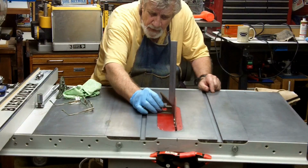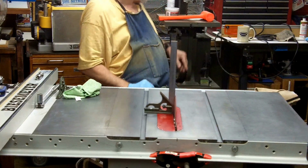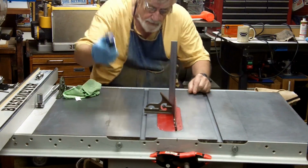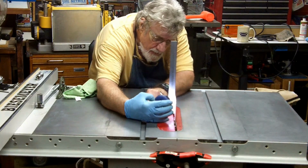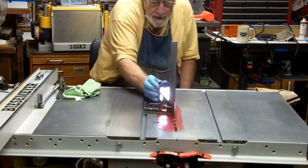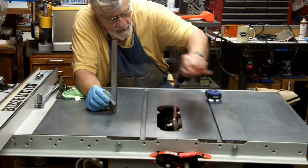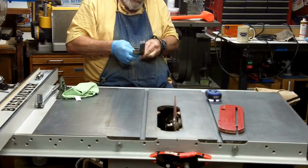A way a lot of people do this is they check it for 90. Now, the way I do it is I try to use the flashlight, and yeah, this is one of those Harbor Freight freebies. Okay, that looks pretty darn good, you know, but the way I do it, I mean, you can't see any light in between, but the way I think is a little more accurate is if you take off the insert and you bring this up like about here.